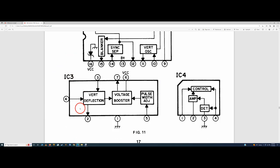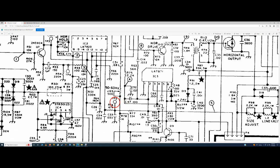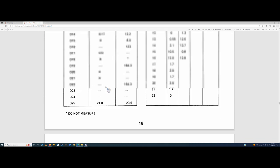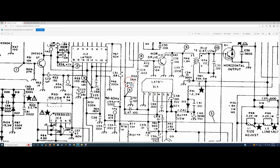Test point 5 is directly tied through R77 straight up to pin 2 of IC3. The manual shows IC3 pin 2 should be 12.2 volts. I don't have 12.2 volts - I have 1.7 volts. So that's our problem: something is pulling our 12 volts down to 1 volt on pin 2 of IC3.